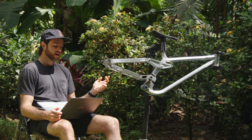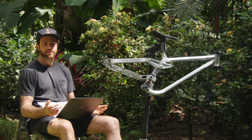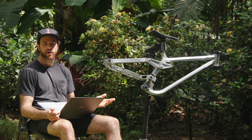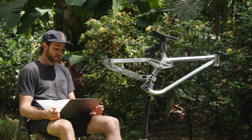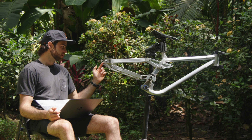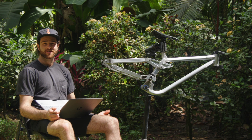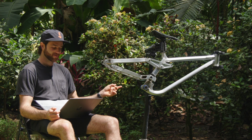For example, the top and down tubes with 0.083-inch wall are about 2.1 millimeters thick. For aluminum, Frank thought that would be a suitable thickness without overdoing it to where the bike is rigid and super heavy. For CNC parts, everything shared from the last bike includes the head tube ZS56 top and bottom, the rear dropouts using the Paragon hanger, and the bottom bracket which is a threaded 83mm shell.